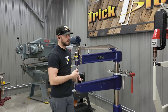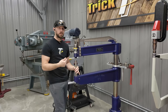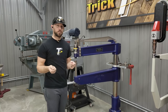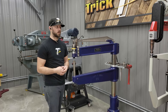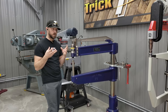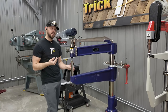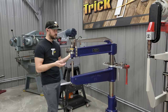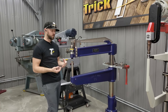This machine is different — the dies are always in contact and the weight on the inside is just doing the hammering from inside. That makes a planishing hammer better for smoothing metal and fine-tuned shaping. It allows you to really work a part to a finished product that's nice and smooth. As opposed to a power hammer, a planishing hammer gives you that ability to really smooth and finish out a panel, though you can do similar work on power hammers with different tooling and aspects.